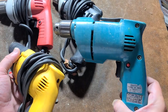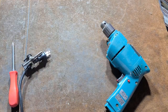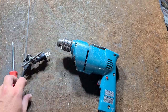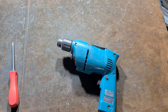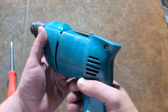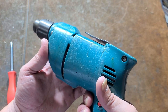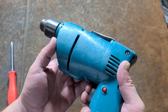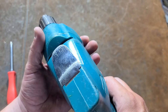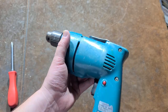I'll do a little demonstration here. This Makita, as far as how it stacks up to the DeWalts, Milwaukees, and Porter Cables, it was the runt of the bunch. So I could be surprised — there may be all ball and needle bearings, but I'm suspecting three ball bearings and three sleeve bearings. Give it a quick run here, then I'm going to fix the strain relief. I think I'll do the teardown first, then the demonstration. The variable speed works fine. Even for a little 3-amp motor — you can hear it — sounds like it's spinning mighty fast, maybe above 10,000 RPM.